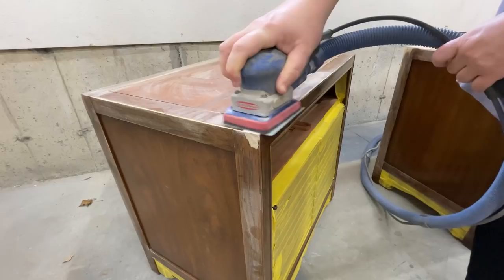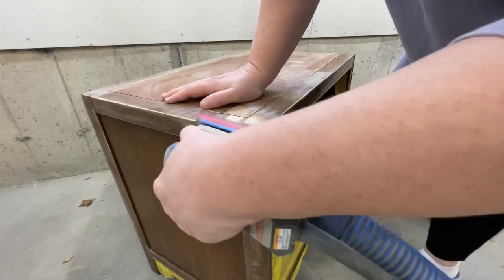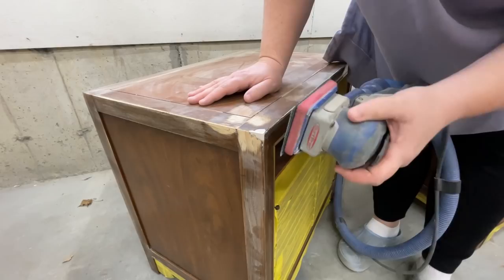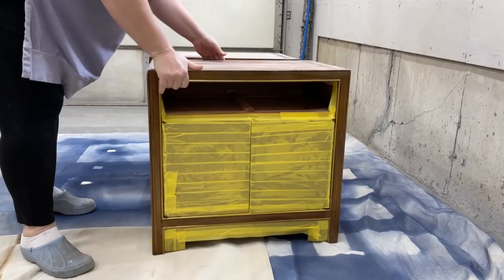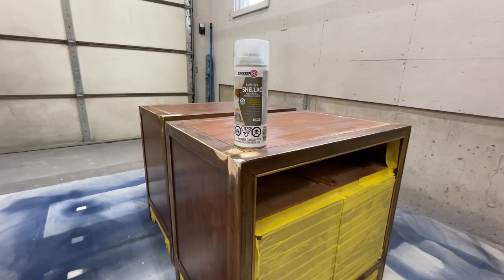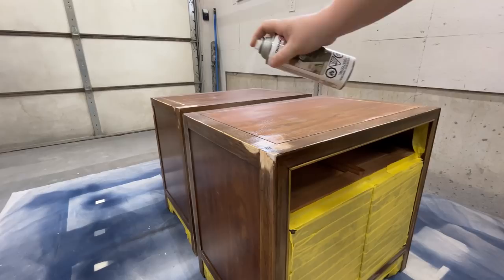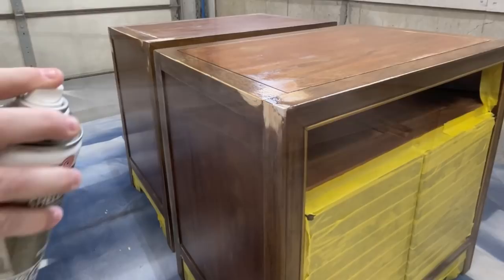When my glue and that putty corner were nice and dry, I was ready to use my little sander to smooth that out and carefully reshape the corner — I just wanted to blend this filler into the original lines. I used a damp microfiber cloth to quickly pick up any sanding dust, and then I decided to use some clear shellac to prime these instead of my usual white shellac base primer. Since I'm painting these black, there's no need for a white primer, but I do still need to seal up the porous wood filler spots and anywhere where I sanded through the previous finish, so that the paint sits nice and evenly on top of the surface instead of getting absorbed into those blemishes.